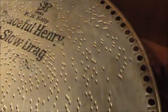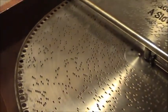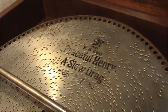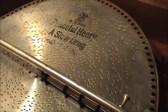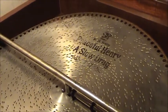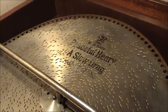You can see it's showing a little bit of corrosive effect — not much, but a little bit around the edges here. But the most important thing with these discs is there's no creases and the projections. If you have all the projections and it's a straight disc — no creases or dents or anything like that — you've got a good disc. Matter of fact, I would take a disc that looks like this, or even worse, as long as the projections are in nice condition and there's no creases in it.